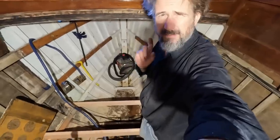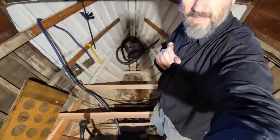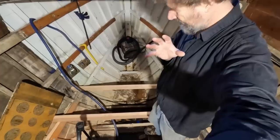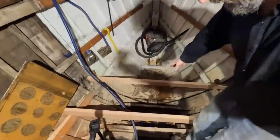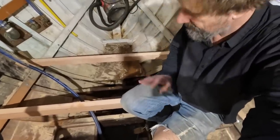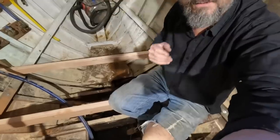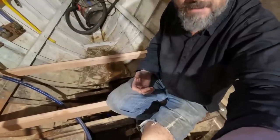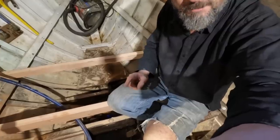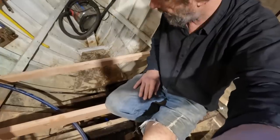All right then, time to get on with this forward bulkhead. And it's not that it's complicated, but it's in a few steps. The lower section, in other words, from the beam down, I'm going to use marine ply, really top-notch marine ply, because I have a little. From here up, I'm going to use mahogany sapele ply because it's pretty, it's much cheaper, and I have some as well. And it's not vulnerable from here up at all.